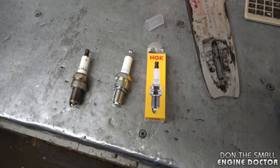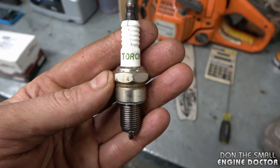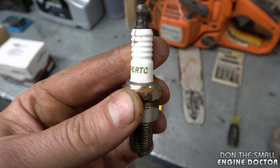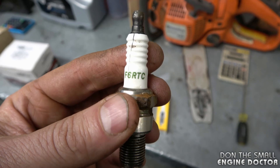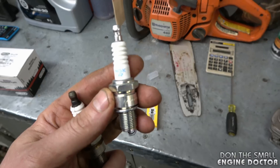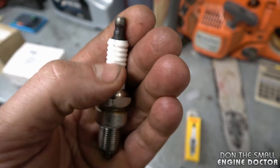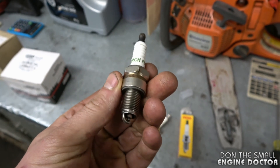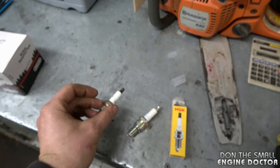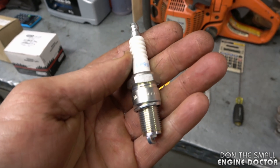The first thing I want to show you today is about spark plugs. In my hand here I've got a spark plug that you get when you buy a snowblower — they're Chinese Torch spark plugs, which is pretty well what all the manufacturers put into their machines. However, I suggest only using NGK or Champion spark plugs; they're much better. This plug here has a huge crack in the porcelain — it was actually defective even though it had a bit of spark. When equipment comes into my shop I always remove them and put a Champion or NGK plug in.